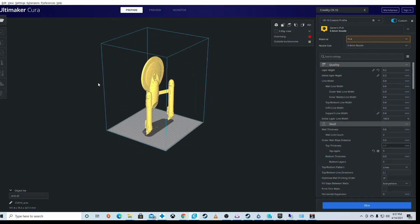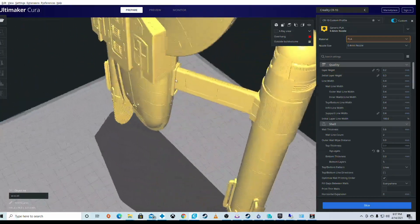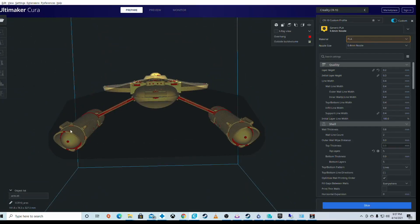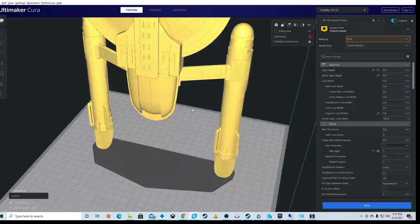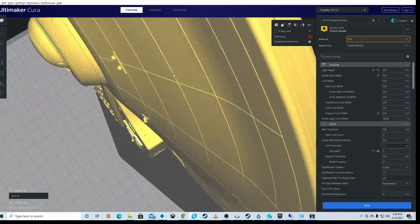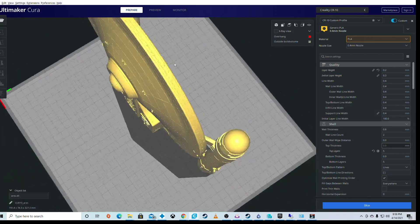According to my notes, I printed it at 275. Looking at the detail just in here — it's gorgeous. There's a reason I turned it upright: the connection points are all going to connect here at the base, and the saucer and everything should build free without much support. It limits the amount of points I have to clean from supports touching the model. I'm going to use my CR10 custom profile and inland PLA+ in gray. I was working on another project and needed to finish off the roll, and honestly when I prime this white, that gray is going to give some awesome shadow detail on the saucer sections.